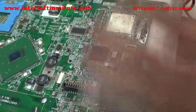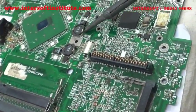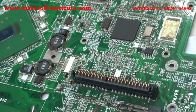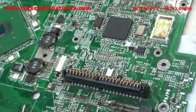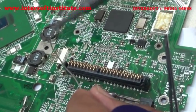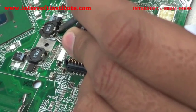To remove the coil — it is an SMD, you can see — one side has been given a solder. We will heat from one side. It is one type of bridge. We will apply some paste first, then give some solder so the inside solder will melt very easily. If we apply more solder, the down solder will release. See how we have removed it.